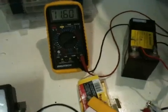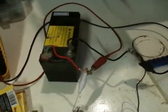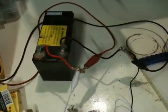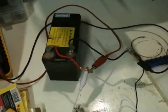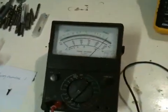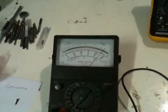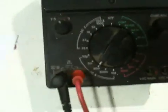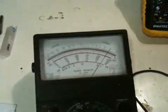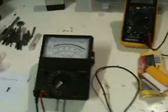So I'm still not sure about this battery load calculation thing — that's all I can tell you. It's pushing in 11.6 volts at 45mA. As you can see, set on the 50mA scale, it's nearly topped out. If I go any higher I actually have to switch over to the 500mA scale, because it swings right off the scale on the needle at 50mA.